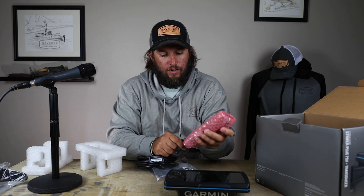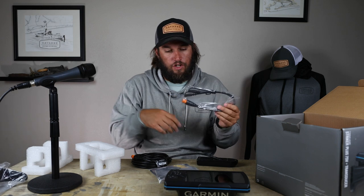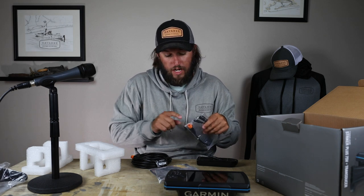I'm going to do a full install video on this stuff too — I just wanted to pull it out so you guys can see it. If you're interested in getting this, the transducer is actually a lot smaller than it used to be — it used to be about this long, so it's a lot more compact now. There's plenty of cord to work with. The orange side connects to the clip I showed you — that's what keeps it watertight. These plug into the back of the unit. This is your power cord; it has a blue and brown wire for radar, which you won't need on a kayak, so don't worry about those.